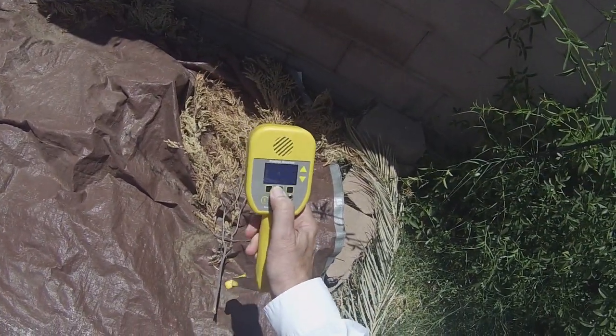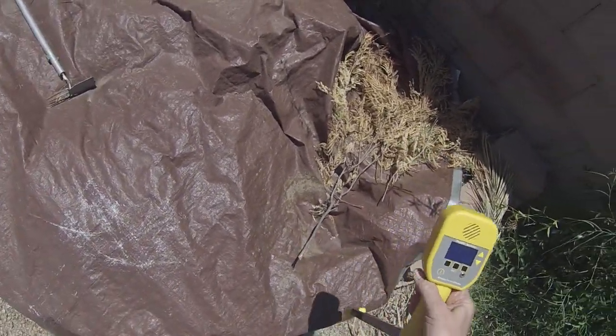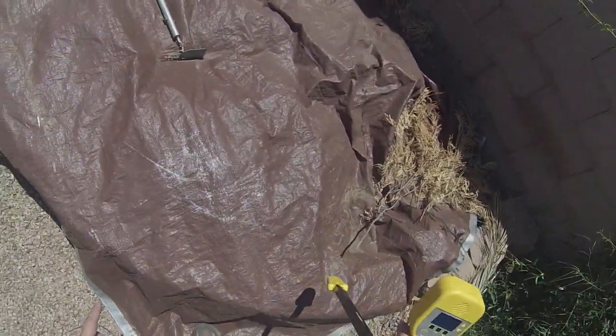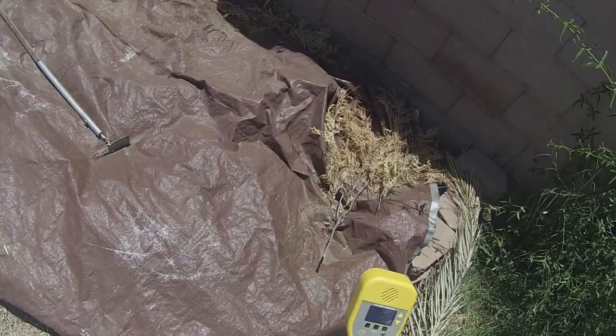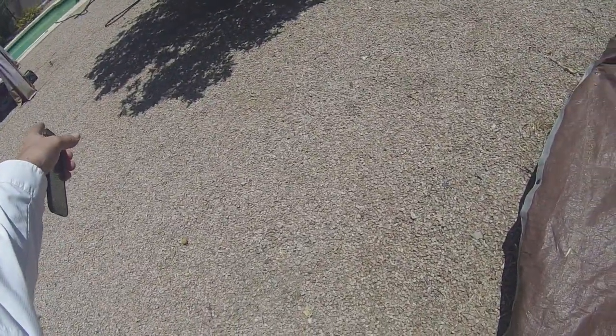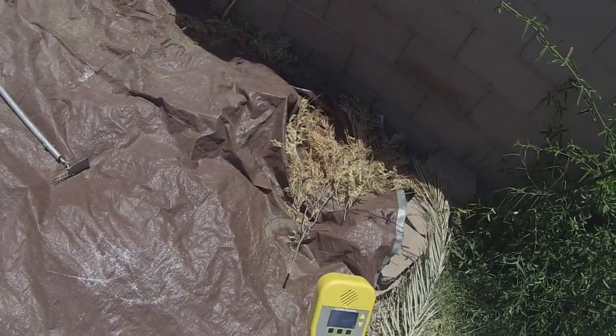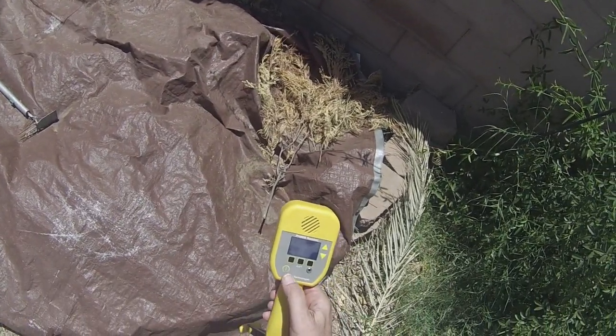I'm going to go back to null mode. So I've managed to track it to this area here. Now what I want to do is actually locate. I have pushed the yellow rod from the Pro 65 in about as far as it will go, which I think probably means it tees in here. Here's my track again — this is a piece of vinyl pipe I would never have been able to do anything with.